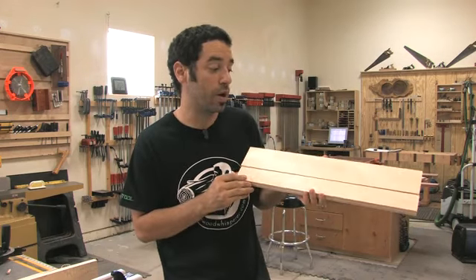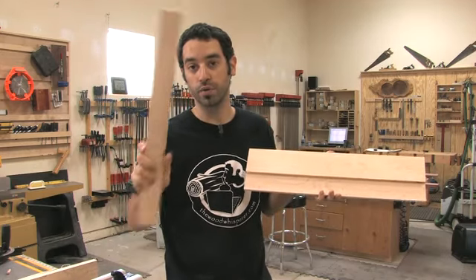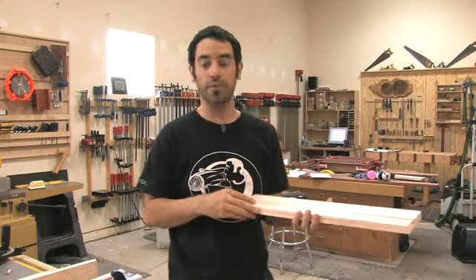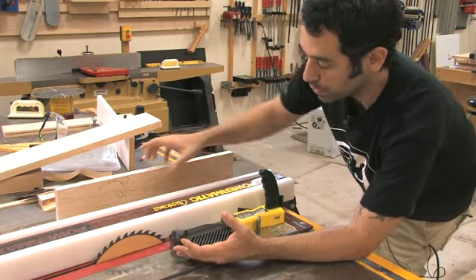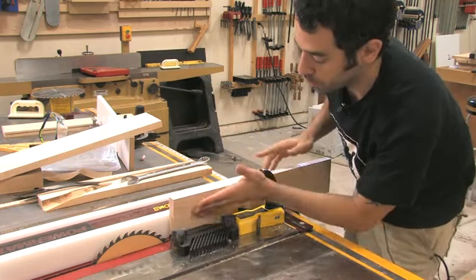It's going to look a lot better than if I just made this cut and then made this piece out of another chunk of wood. I used the table saw to do this operation — let me show you the setup. Because you're removing a lot of material, it's kind of a dangerous cut. I have feather boards in place that give me absolute security as I go through this part of the cut.